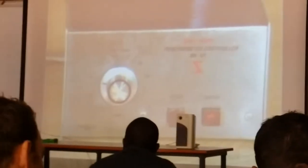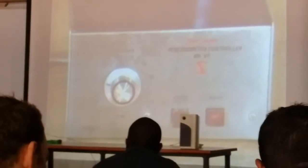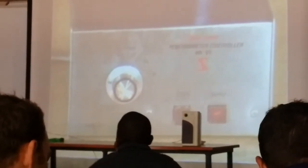The following apparatus is needed to successfully complete the test. A penetrometer that allows frictionless vertical movement of the needle holder. A timing device capable of measuring a 5-second duration accurately. 3 tempered stainless steel penetration needles that meet ISO specifications. A needle holder and weight.